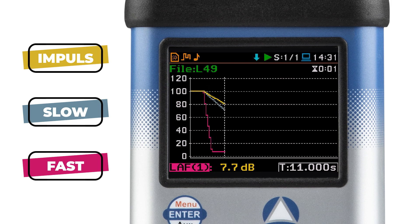Now, fast, indicated in pink. When we shut down the sound source, the measured level drops the quickest. A sound level meter set to the fast setting responds to changes in sound in 125 milliseconds — that's about eight times faster than the slow weighting response.